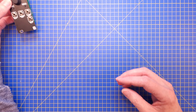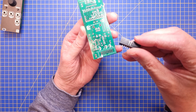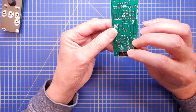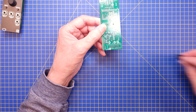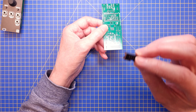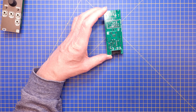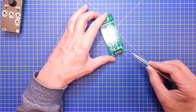My plan is to solve it like this. Here we have the PCB and the 16-pin connector. If I instead want to use only 12 volt and minus 12 volt, I will use a 10-pin connector. I thought it was clever to place the voltage regulator at this position on the board.